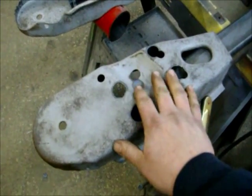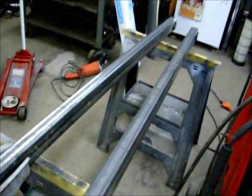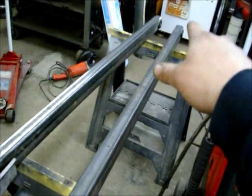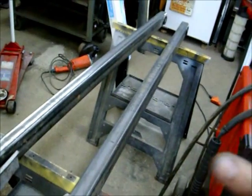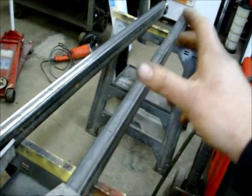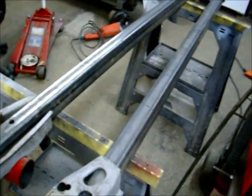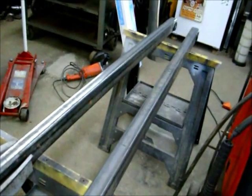They had a torque tube, but it was kind of set up the same way as a truck arm. Other than having two pivots, it just had a big ball socket that went in between the X-frame, and then there was a small little jump between that and where the transmission was on the Buick with the straight 8. Obviously we're not using that system, so this is what I came up with.